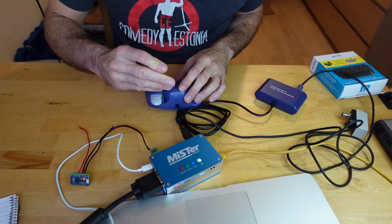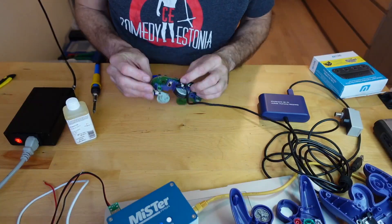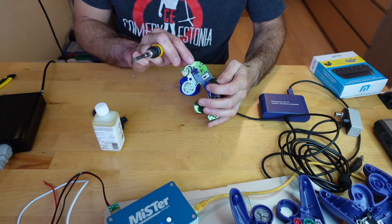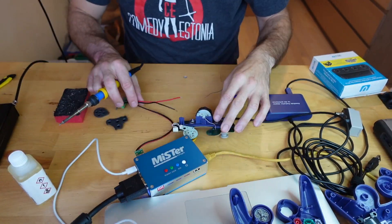To get around this, I've got a USB-to-GameCube adapter so I can plug the GameCube controller in and it has USB on the end. I've got two of them — the original Wii U one and the knockoff AliExpress one — so I've got two sample points. I'll run the tests with just the regular wired controller first to give me a baseline. Then I can do the same test with the WaveBird, do a bit of simple mathematics, and determine what the lag of the WaveBird controller is. The Wii U official adapter didn't work with the MiSTer at all, so I've still got one adapter to use.